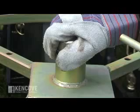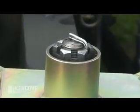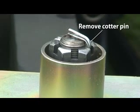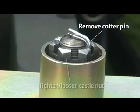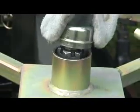To prevent over-spinning and tangles, each tier of the jenny has an adjustable drag feature. To adjust, simply remove the center hubcap, bend and slide out the cotter pin, and tighten or loosen the castle nut to the desired drag. Afterwards, insert the cotter pin and replace the hubcap.